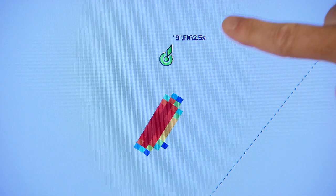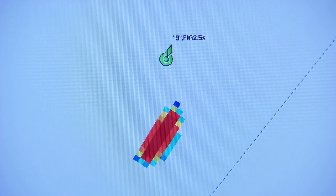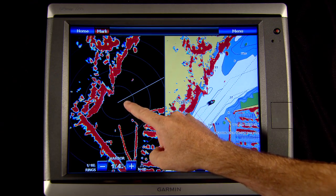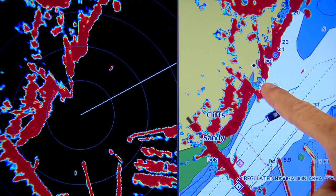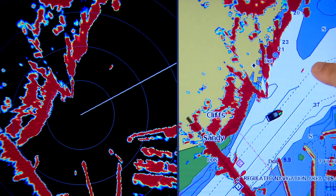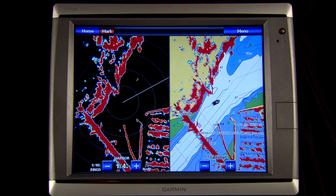For example, the chart says a green buoy should be right here, but the radar return is showing the buoy slightly offset — since radar data is real time, that must indicate the buoy has moved due to local conditions or currents. If you just look at the radar screen by itself, you can see lots of returns but don't know if it's land, a storm cloud, or a vessel. But when you overlay radar onto the chart, you can figure out that a return is from a land mass, that a crossing return is a bridge, and that an uncharted target is probably another boat.